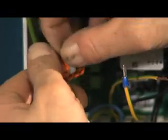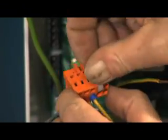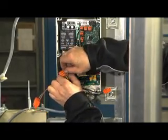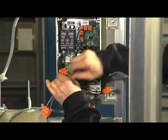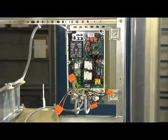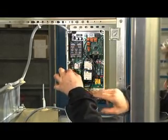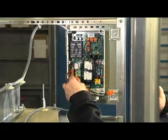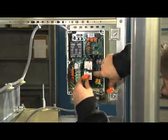The plug connector X06 will be connected to the first slot of the neutral conductor. The PE conductor will be connected to the remaining 4 slots. The power supply of the main switch needs to be connected to X01. Please note, one slot must be left free between each phase on the 5-pole connector for the three-phase current of motor and power supply.